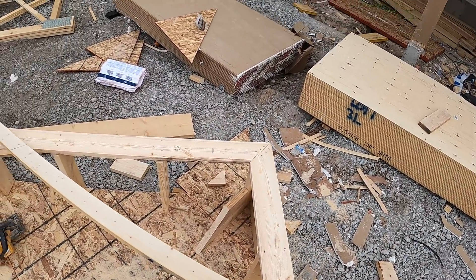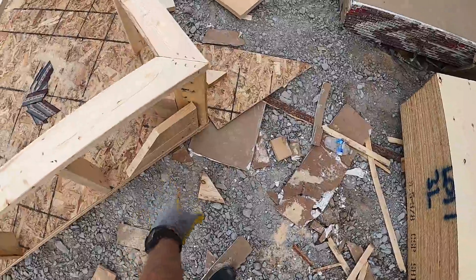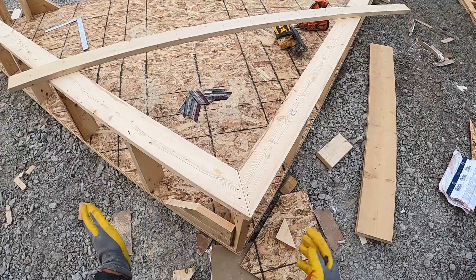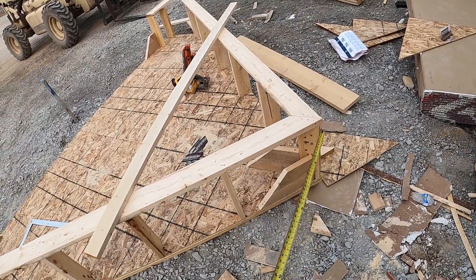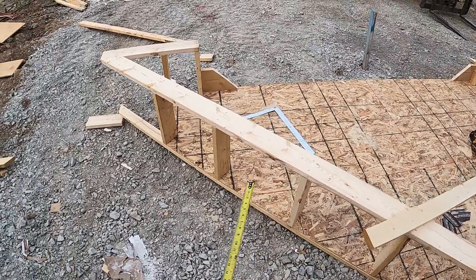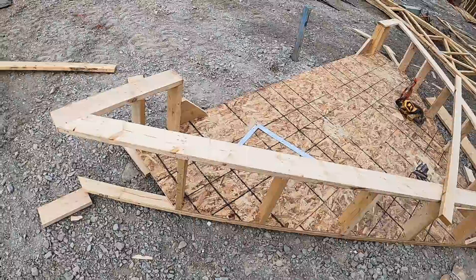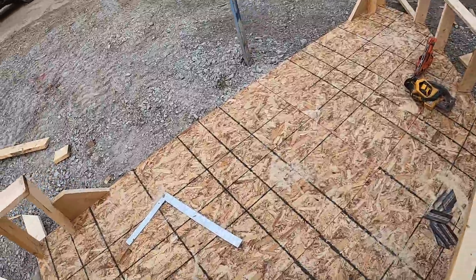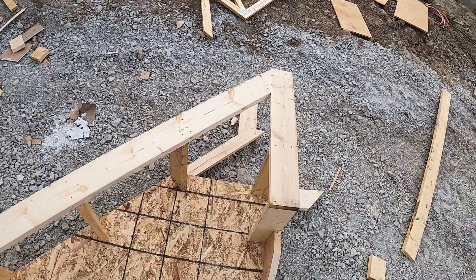Just make sure your cuts are very straight, because it'll only be as straight as your cuts. I've also put a two-by-ten on the side to keep it straight laterally. When you're pulling your two-fours, mark the tops — it just makes it look nicer and it comes out straighter. So right here I have a very simple 7/12 little skirt.